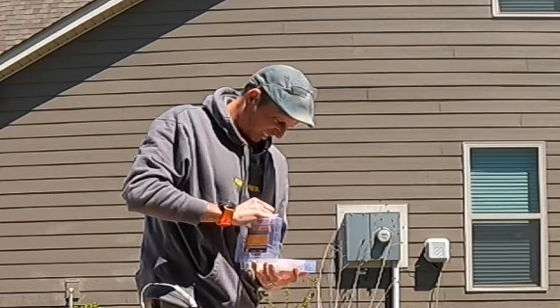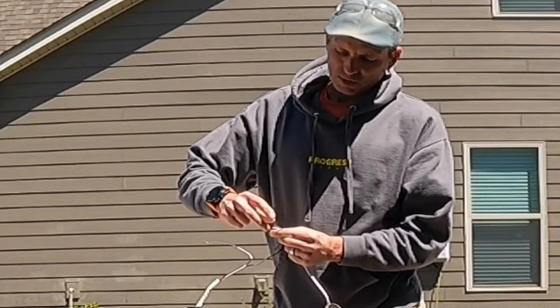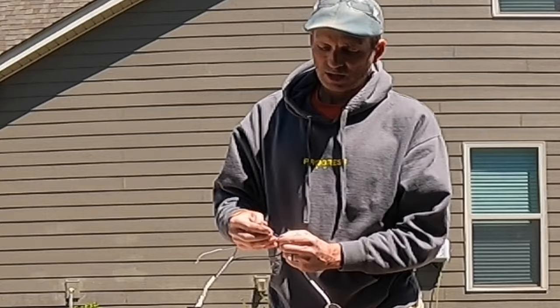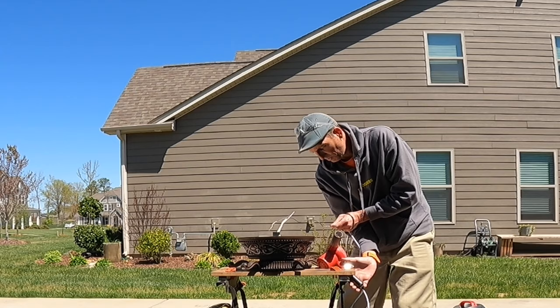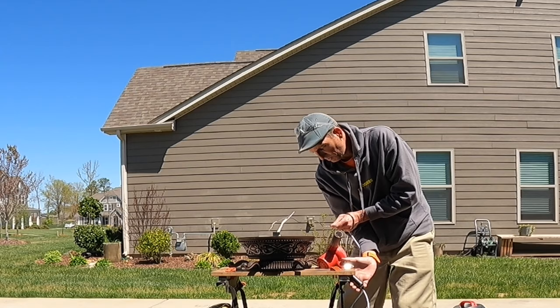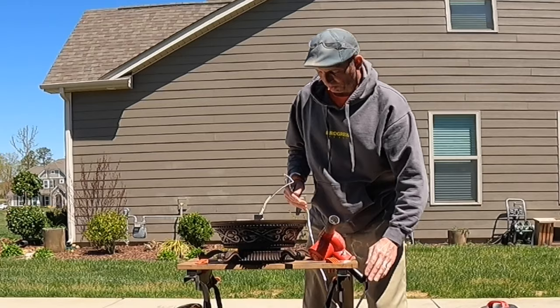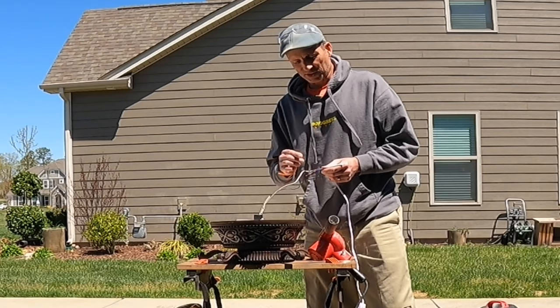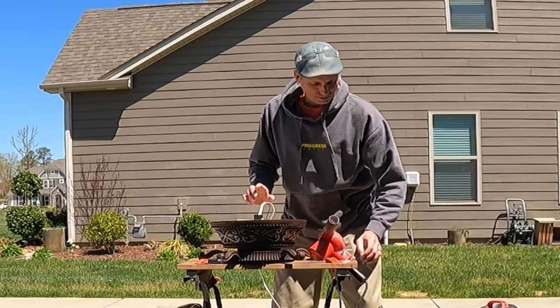These little guys are heat shrink and solder combined - you stick your wires in there, use the heat gun, and it melts the solder and shrinks it all in one shot. One side done. The nice thing about these connectors is the heat shrink is supposed to seal them up tight. I still go over it with tape to create a stronger bond - I don't like cords that can be pulled apart. Are you like me - can you never find your own tape?